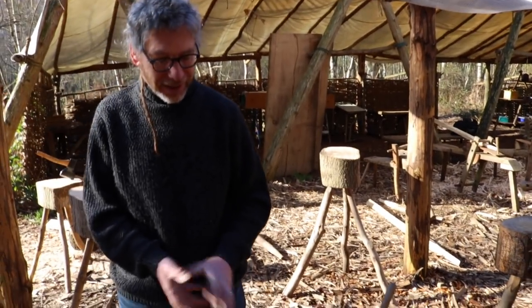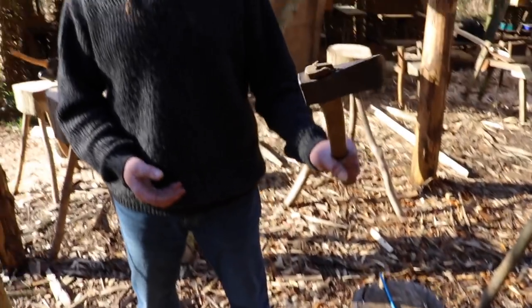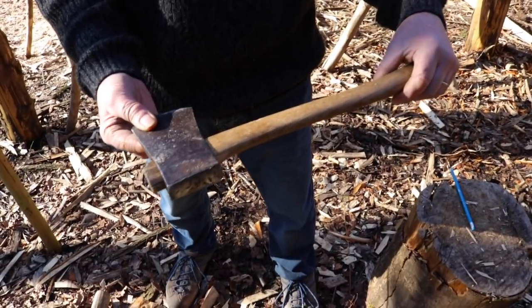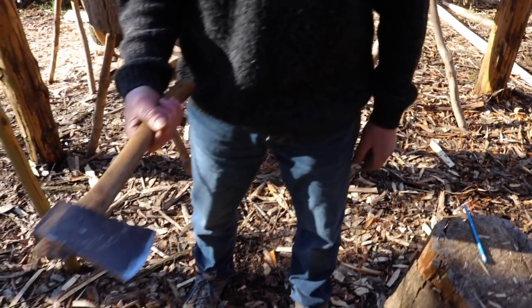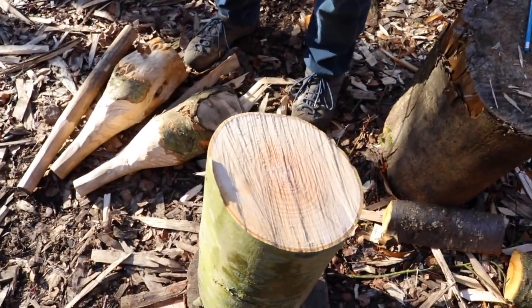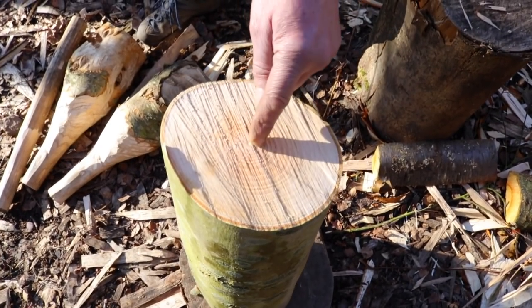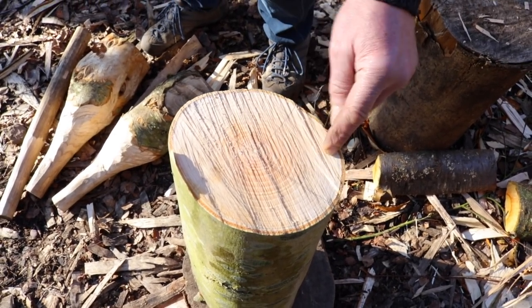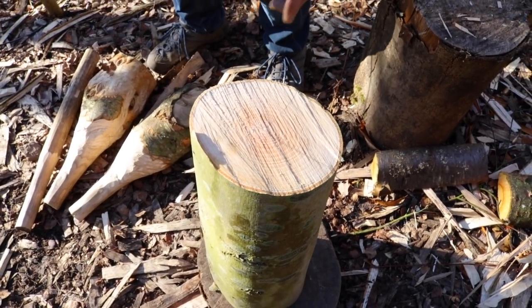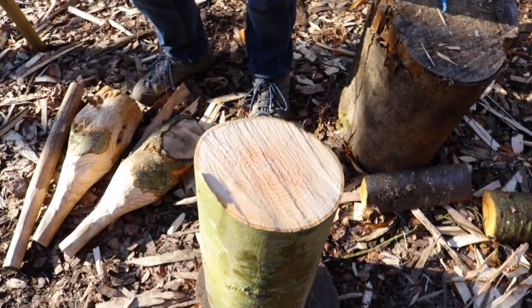What we need to do is cleave it and split it down to the right size. For that I use an axe — a simple felling axe found cheaply at the boot fair, I think it's a Braids number two. We're going to place it on the wood. The basic rule of thumb for cleaving is to split equal masses on both sides — split in half down the middle, then half again. You can keep splitting tangentially and radially to whatever size you want, but the basic premise is equal masses, half and half, so that the split doesn't run off.